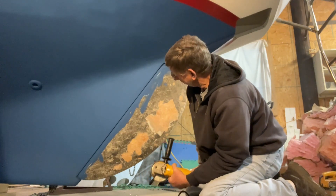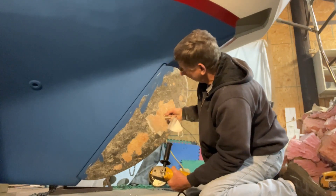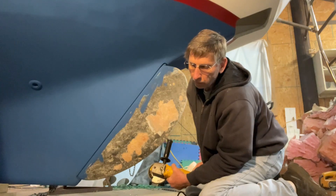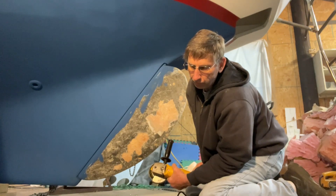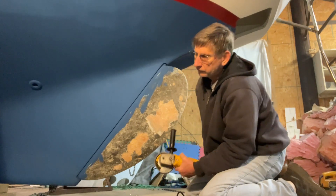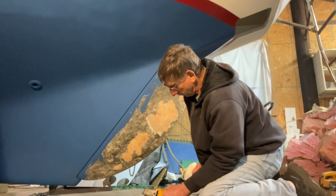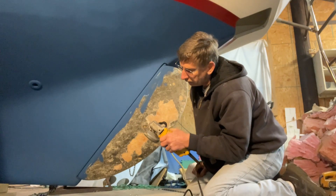One thing I will mention: when you're sanding like this, you're sanding basically barrier coat, which is an epoxy-based material, and the rudder itself is made out of polyester resin and fiberglass. The epoxy barrier coat can be harder, so you have to be really careful or you'll end up gouging the original fiberglass and polyester resin. You have to be careful as you transition from one material to the other because the pressure you put on the epoxy will gouge into the polyester pretty easily. You need a kind of a light hand so you don't end up with a lot of extra fairing to do. This flat disc is taking it off really easy — it's 80 grit.